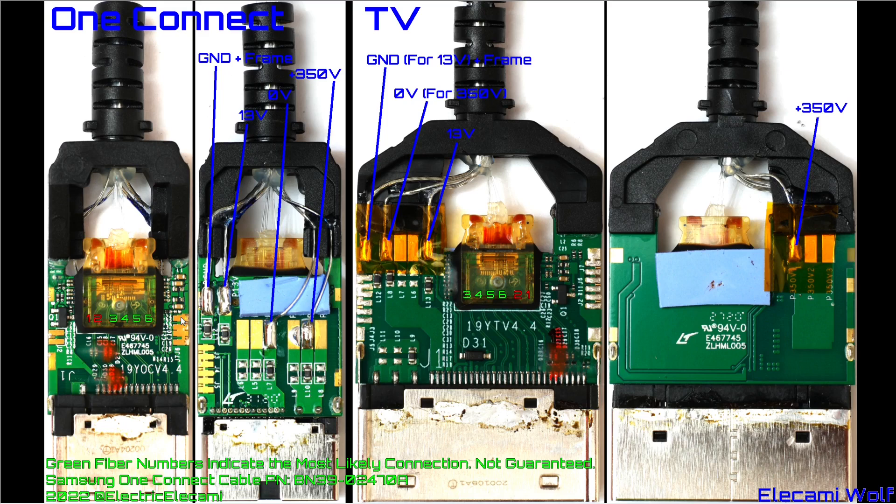By the fact that on both ends of the cable one of the pairs is singled out — and it's got a via wall ground around it — that made me think those ones connect to number six here. And then the others follow in order, which matches the way the four video fibers were arranged on the older One Connect cables. So I'm fairly confident that is the connection, but I can't guarantee it because I haven't chopped any of my cables in half and tried to rejoin them to prove it, and I don't have any other way of proving it without creating some crazy rig to try and power up these in some way that I can identify which end is which.